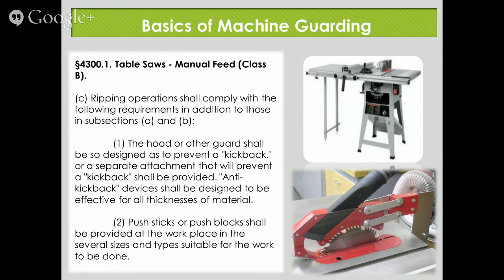Not all machines have a specific code like the table saw does — table saws just create so many accidents, they made a specific code. But a lot of these codes are general and vague. These laws are universal: if you've purchased a table saw without one of these devices on it, there is no grandfather clause. If it's not in use, it better be unplugged, locked and tagged out with something over the outlet marked 'not in use, out of order.' Because if Cal OSHA doesn't see those things, they're going to assume it's in use.